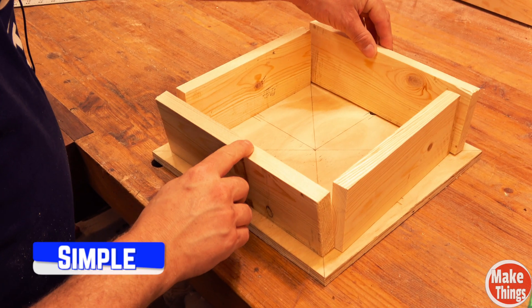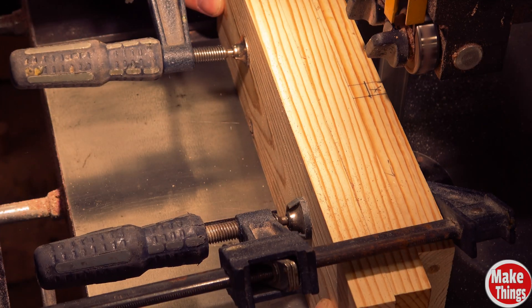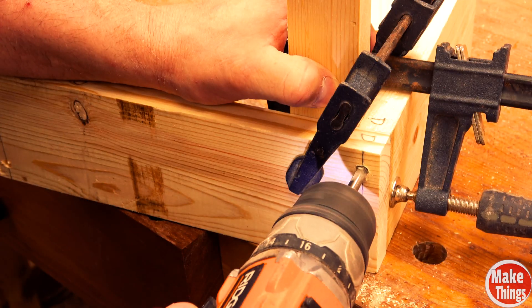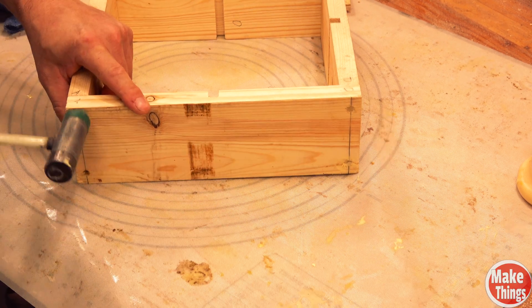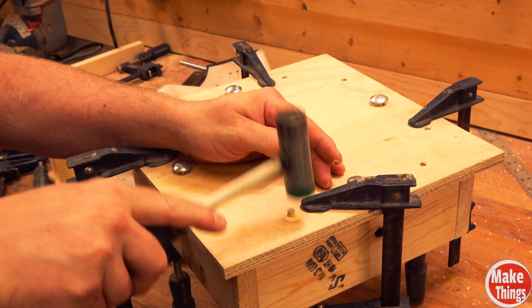Next down we have the base. The simpler version uses four boards that are butted up to each other, making a box. Channels are cut in each of the four 1x4s to help protect the 3/8 bolts. Dowels are added in the corners to attach each wall. Finally, a piece of plywood is attached to the top and dowels are added again.